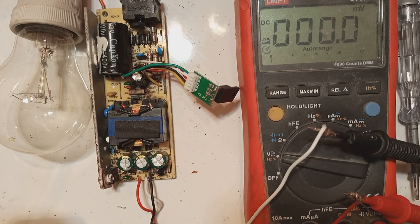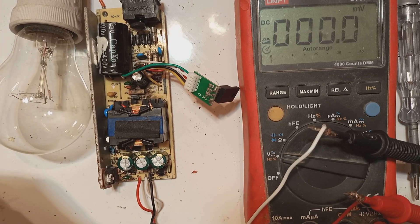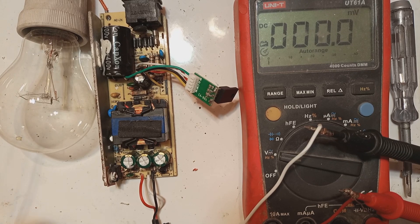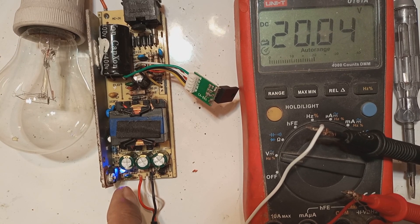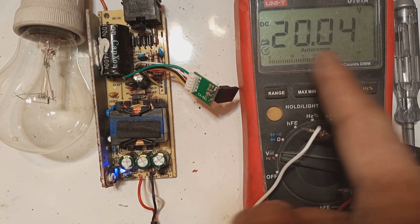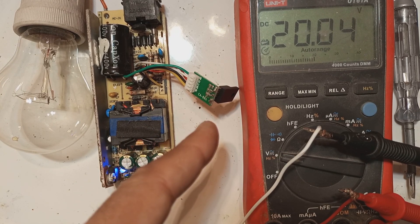Here is a series lamp — we will connect this power supply through the series lamp first, and then later connect it normally. There is also one LED indicator that will glow if the power supply output is correct. A blue LED will show the status of the power supply. Connecting it to 220 volts — the blue LED has come on, showing the power supply is switched on, and the meter reads 20.04 volts. The power supply is repaired with the new add-on module.